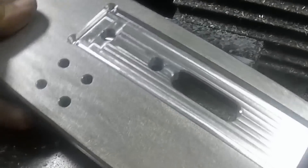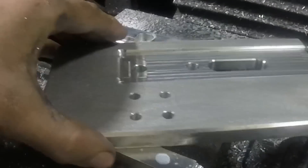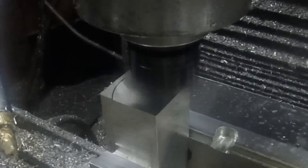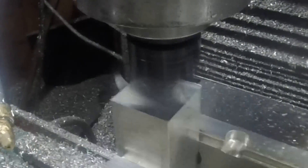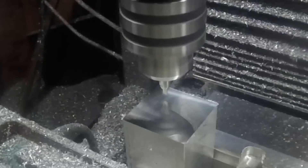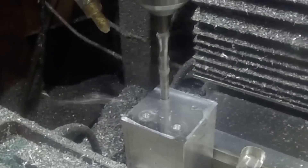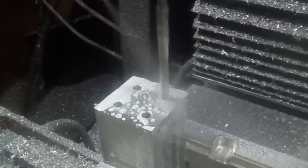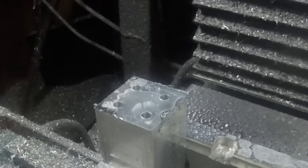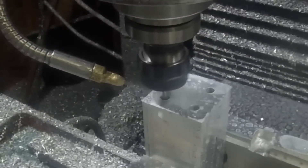Here it is after I just knocked it down with the orbital sander. The process for the other one will be the same — it's just a little bit bigger. This is the pedestal. It's just going to have some corresponding holes to match the ones in the plate: two pinholes and two bolt holes. The pinholes are for alignment. The hole punch is going to have one pedestal and the bigger punch is going to have two, one on each side.